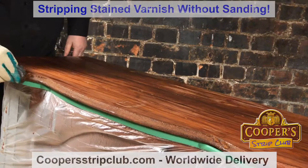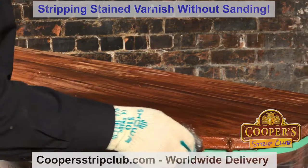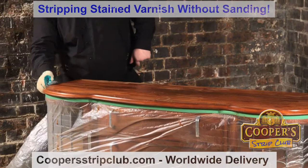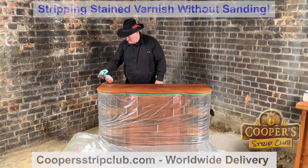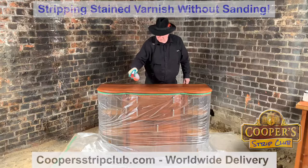On a moulding like this, a chunk of steel wool is ideal. Remember it's sanded already, so why sand off all this varnish and take forever? It gives you a really nice natural end. Remember that when it was made it was sanded and then the first coat of varnish went on and that soaked into the grain — and that's the one that we're after.